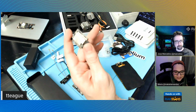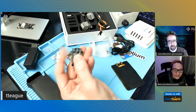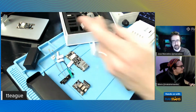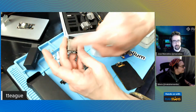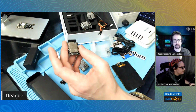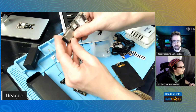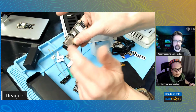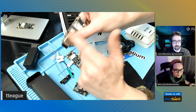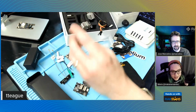A lot of you will recognize this. Hopefully, this is an ESP32, which has wireless or Wi-Fi on it. I'm going to let you explain this, because you just released a new core module based around this as well. This is a little different than what is available there. This will connect over on the I/O and allow you to Wi-Fi enable a project, or you can program just on this and talk to the two over UART, using AT commands.